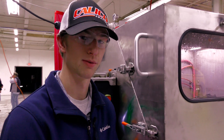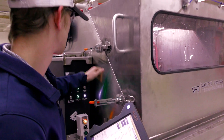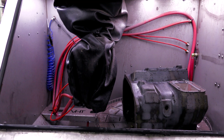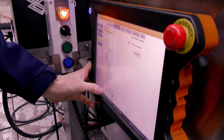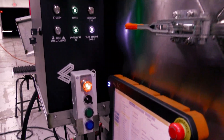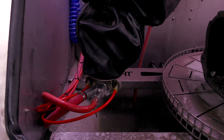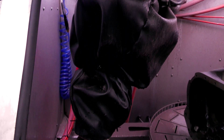This is a collaborative robot and it is housed inside of our shroud. The reason we decided to go with a collaborative robot is because it makes it so much easier for you to program at your shop. With a robot like this you don't have to worry about anyone getting harmed because they do have all the collision detection. This is a six-axis robot and it is more than capable of maneuvering and positioning exactly where you need it depending on your part.